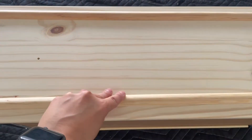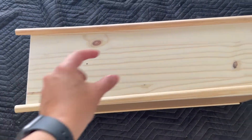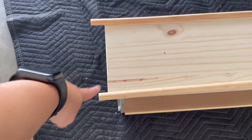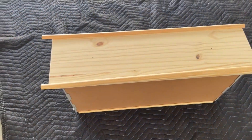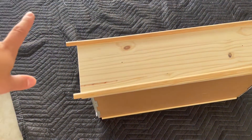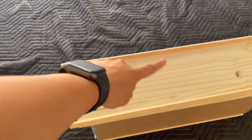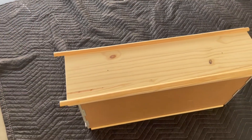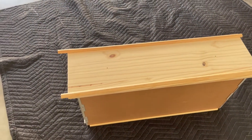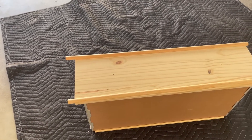I'm thinking I'm going to frame the drawers, and I have to cut these at a 45-degree angle to make that frame. I'm going to get started with the outer frame, and I still haven't decided if I want to do more, like maybe one in the middle, so I just know I want the actual frame of the drawer front and hopefully that will help me visualize it.